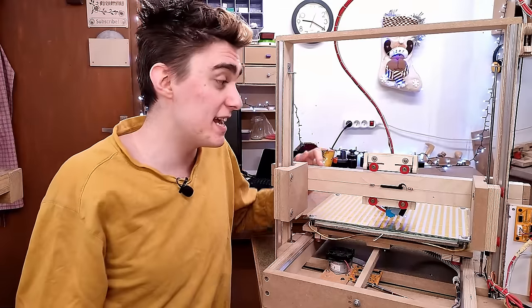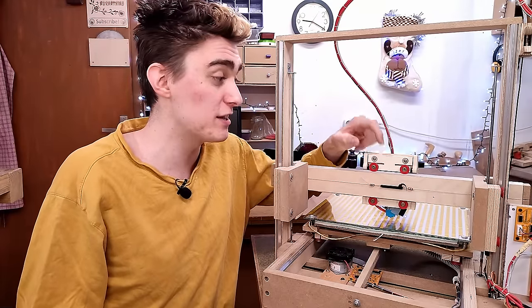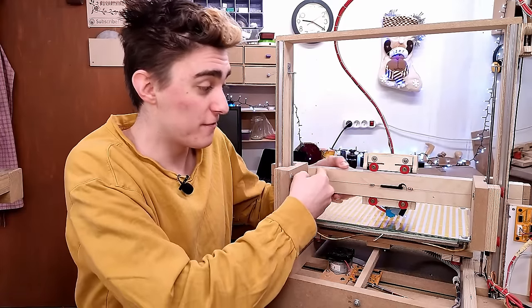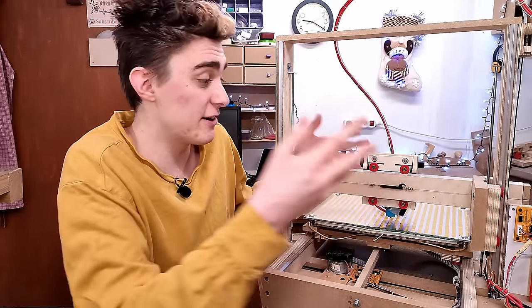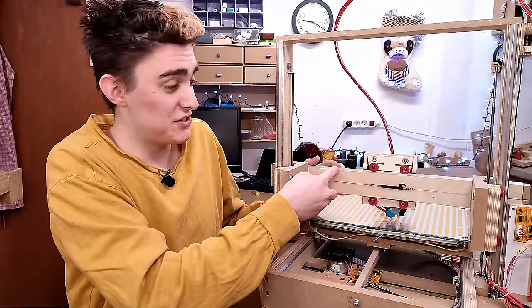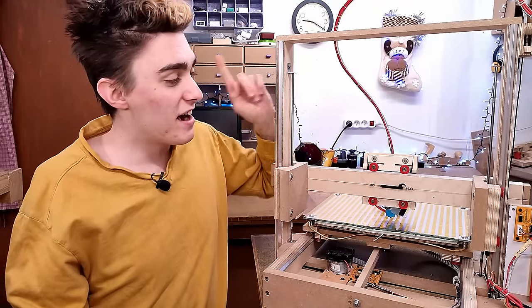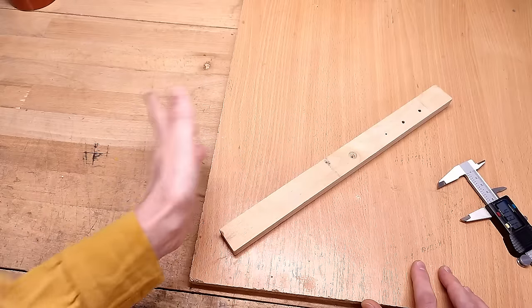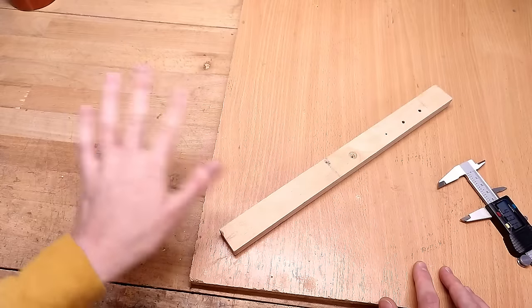Something that was not a mistake is my compliant mechanism spring-loaded rollers. In fact, I think it's the only thing that makes using wood for the primary structural part of the linear rail even feasible. So if your design depends on two edges on a piece of wood being parallel, I highly recommend you make two of the rollers spring-loaded, because in woodworking, straight and parallel do not exist.